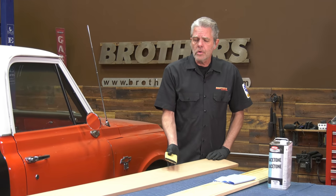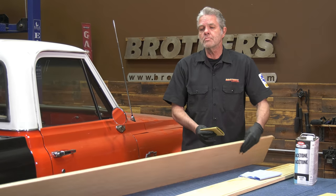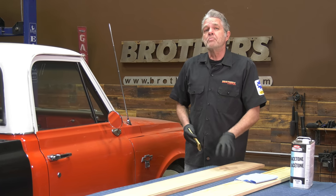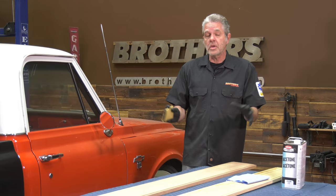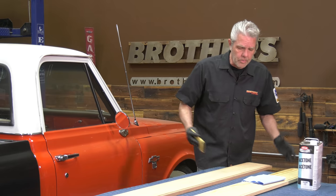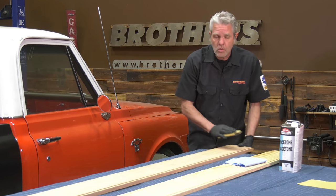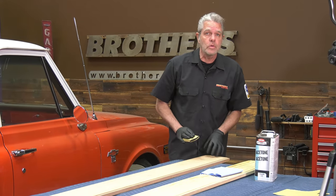When we're sealing and top-coating our wood, if you didn't do anything at all to the wood two things might happen: it's either going to dry out and crack, or it's going to soak up all the water. Boards are like sponges - they'll soak up everything and then swell up. By sealing them we're keeping them from drying out too much and from soaking up moisture and swelling. When you're doing your sanding you always want to go with your grain. If you go across the grain those scratches will show up. If you use a jitterbug or DA sander those will generally show up too.